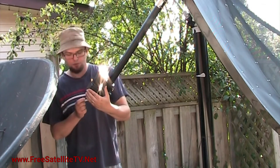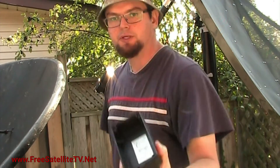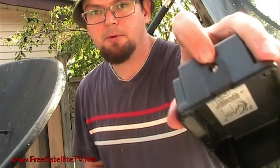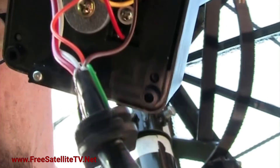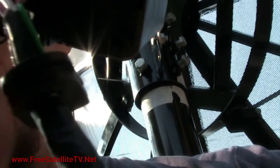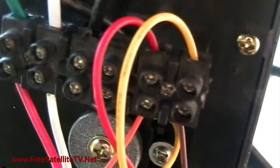The actuator has four screws. The instructions should be on the back of the covers showing where you need to put your wires, and there's a little rubber protector here. You have your power cables coming in here, and make sure before you thread everything through that you have the protector on first. The thicker wires are the electrical ones and the thinner wires are the reed sensor ones.